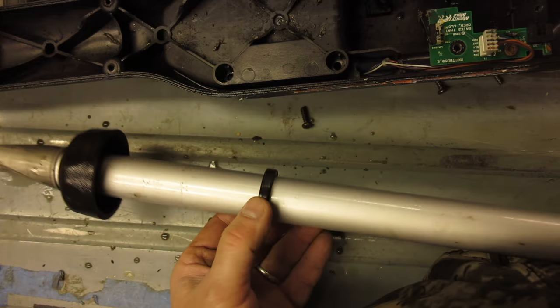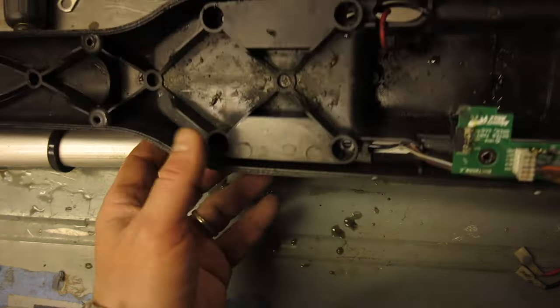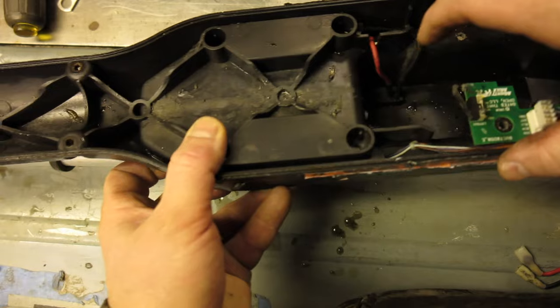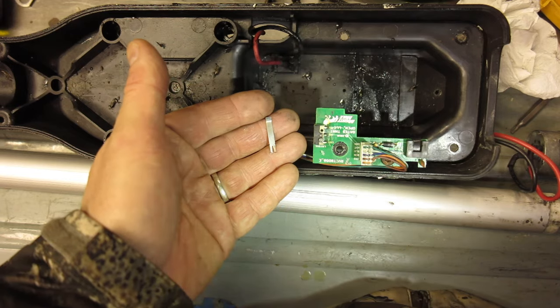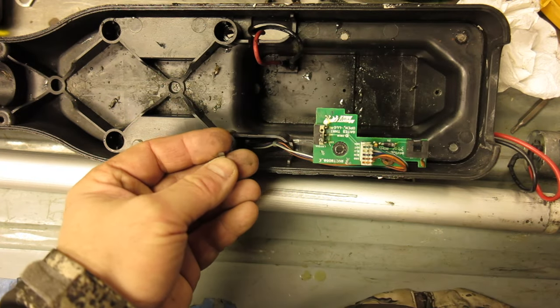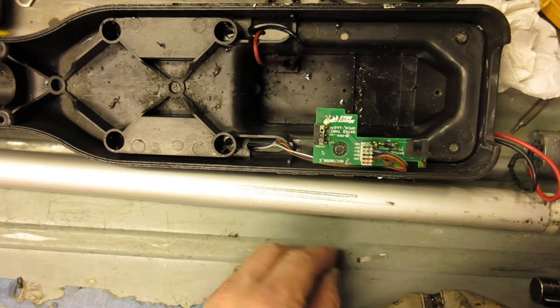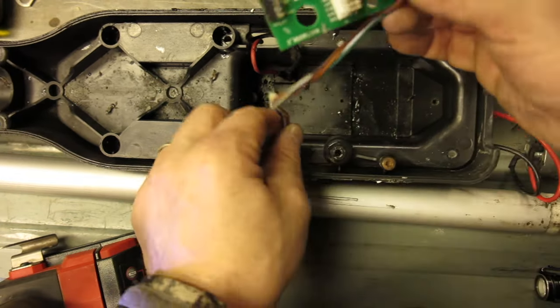This is a little gasket that rides on the shaft and it's either not doing its job or condensation is an issue. I'm going to need to fix this little limit switch and see if I can take the arm off this little lever, bend it back into place, and reuse that switch — or if I'll need to solder in a new switch. To do either, I need to take this circuit board out and take a look at it.